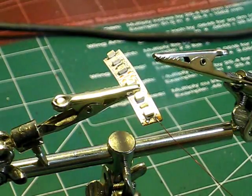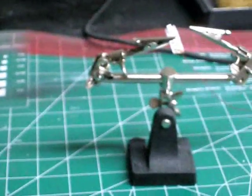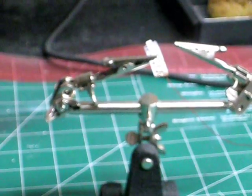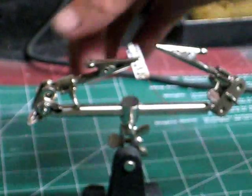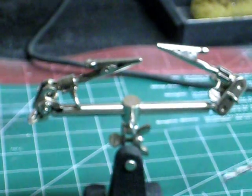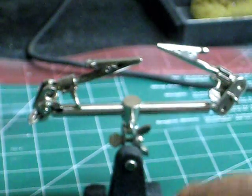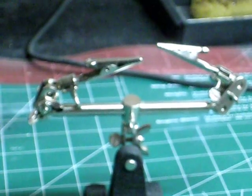It really helps to be able to see well — you've got to get down in there. I'm looking through this big magnifying lens with the light turned on, and that's how I'm doing it, aiding me in seeing it and keeping my hand steady. The same thing applies to soldering bulbs or any kind of small soldering — just using a little bit of solder, not too much, and making sure that everything's clean and pre-tinned. That seems to do the trick.